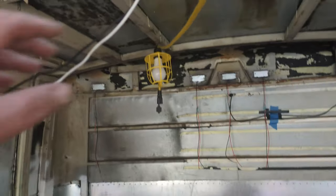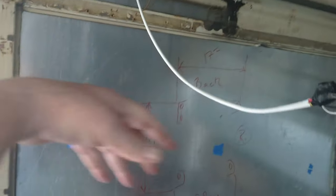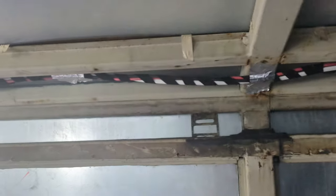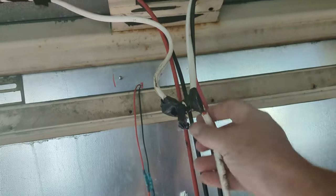Let's go take a look at what I was doing in here with the wiring. I was running some Ancor marine-grade 12-2, 12 gauge two-wire stranded cable — it's a bit overkill, but it's all I had, and better too much than not enough. I've hooked it up to the MaxAir fan. Where the solar cabling comes in goes in here. I've got them taped together, and another one over here does the same thing. Lever nuts are under here — I just taped them together for peace of mind. These two cables meet, connected in parallel to one cable that goes down to the DC fuse block, and that provides power to both fans. It may also provide power to any lights we have down here — we're thinking of LED strip lights along the edge of the transition from the walls to the ceiling instead of puck lights.